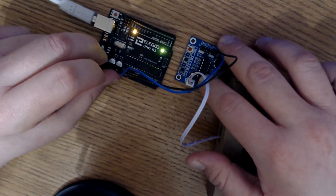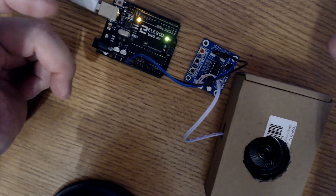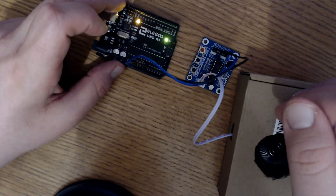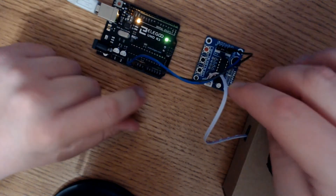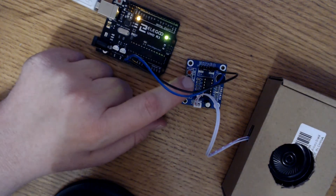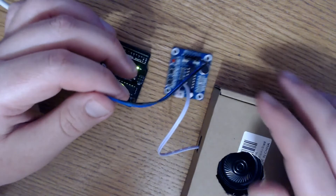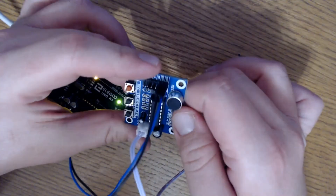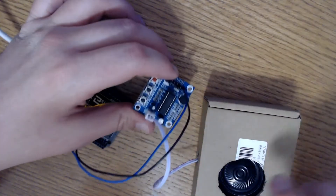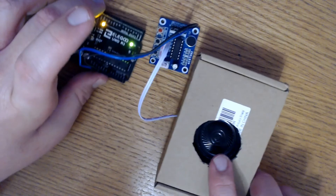If you want to use this as a standalone record and playback module, you can just provide power and ground off of the Uno, or you can use a breadboard power supply or battery pack. I'm using 5V here, so you can record by pressing the record button and then play back. You could use a Nano, smaller wires, and a battery pack and pack it into something the size of this box, making your spy microphone compact and easy to take anywhere. Overall I was pretty happy with this — it is cheap and it's just a learning module, but I was able to make an okay spy microphone. Well, that's all for today. Thank you very much for watching. If you like the video, don't forget to give it a thumbs up and subscribe, and I'll see you again very soon.